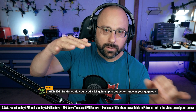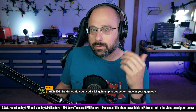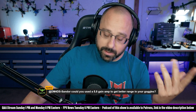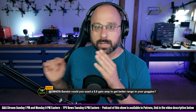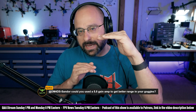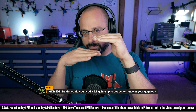And let's say the noise floor — the ambient background noise, which is always there — is at negative 95 dBm. There's always background noise everywhere in the RF spectrum. Some places have more than others. Here at my house, if I shut my Wi-Fi network down, the noise floor might be around negative 115 or 120 dBm. But in the middle of Manhattan, the noise floor could be like negative 60 dBm because of all that Wi-Fi and interference. So if my video signal is at negative 90 dBm and my noise floor is negative 95 dBm, my signal-to-noise ratio is 5 dB — and let's say that's enough to receive the signal.